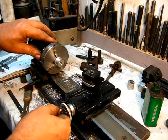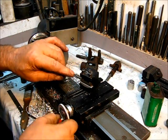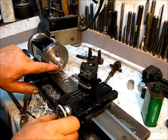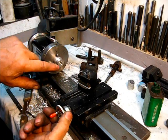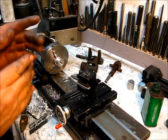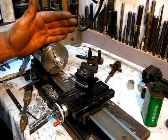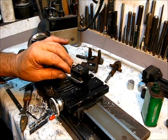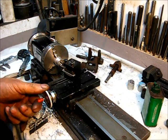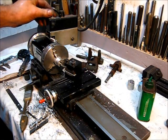Let's get on with the show. The drill bit looks good, and that was a freehand grind on that bit right there. What I will do is when I get to the 60 thousandths wall thickness, while I'm at the bottom end of the cut, I will traverse the table backwards and make just a skim cut, and that will flatten up the bottom of that cut. Not that it needs to be exactly flat because a spring fits on it, but to be precision it needs to be within a half a thousandth. Let's make a cut.